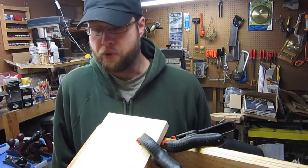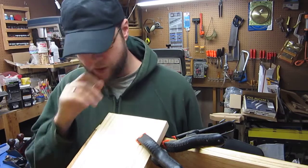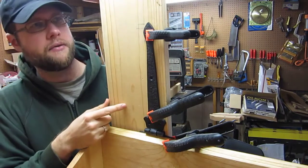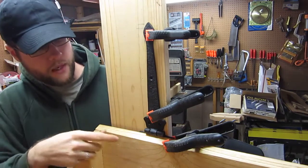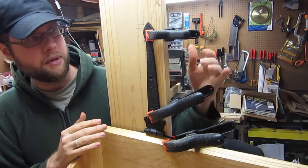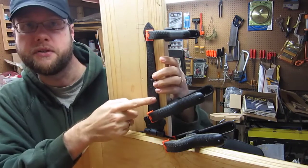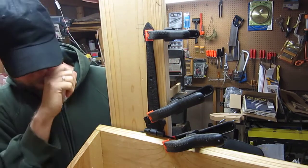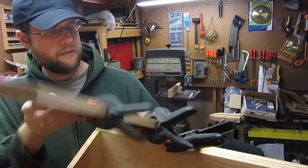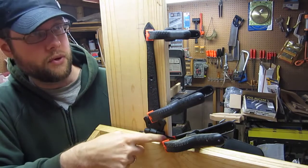Now I'm going to be working on figuring out how to put the hinges on the lid of my chest. What I've done here is taken a scrap board which is about the same width as my lid and temporarily clamped it in place — I couldn't use the full lid here because then I wouldn't have room to clamp onto these strap hinges I'm going to use to mount the lid. So I've clamped it so I can move it up and down and figure out how much I need to mortise out of the back edge for the hinge barrel to fit.